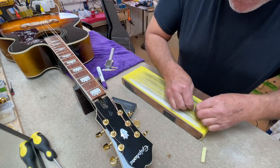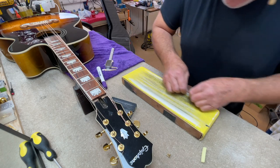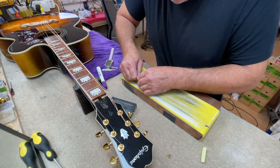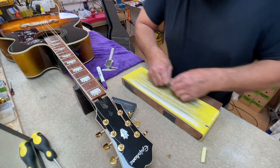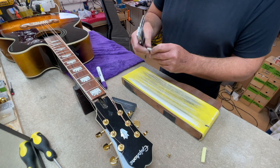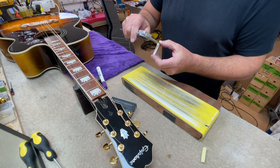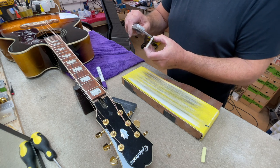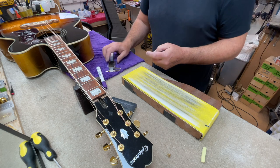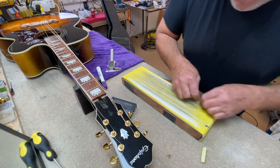We can make it slow and repetitive, or we can press really hard, in which case that's where we run the risk of it changing its lean and we have to correct the angle a bit. So I'm trying to just aim to keep it the same on both sides. So it's a very tiny amount that's going to be left on here, but that's the way. So 8.7, 8.75, 9.2. Yeah, about the same amount gone on either side. So I just need to keep going.